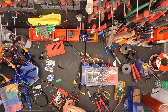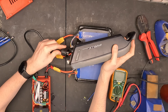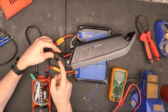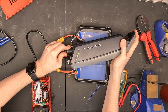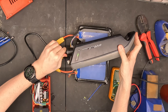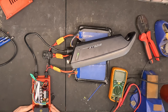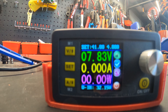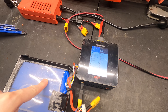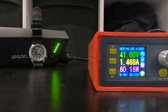Now it's time for a very scary test. Is this how I explode a thousand-dollar Bosch battery? And if I did, could I even get another one in time — would I spend a grand on another one? Connector in, 5 volts on and the BMS wakes up and displays the battery level. Nothing's emitting smoke. I turn the 42 volts on with the current limit set to 4.8 amps — a flashing light indicates it's charging, though the input voltage is dropping rapidly, getting down to 30 volts a lot quicker than expected. It turns out the source battery was flat — we'd put 8.2 amp-hours into it; a little too long left in storage. A further test with it fully charged achieved much better results and all was good. It was charged up again and ready to go.